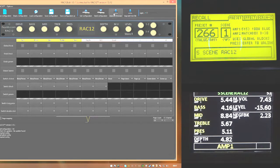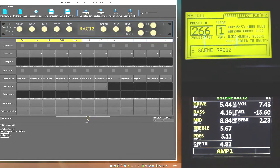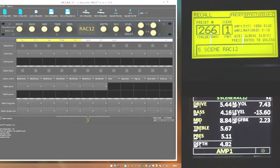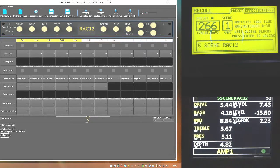On the right-hand side is the communication panel for the unit. These are lit up and colored, which means the unit is actually connected, as you can see in the bottom right of the screen. This button gets the configuration currently in the unit and puts it in the software. This button sends whatever you've set up into the Rack 12. These are for firmware. There's also a slider on the bottom to control the illumination of the Rack 12.